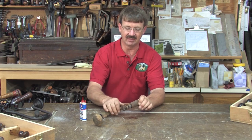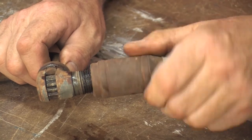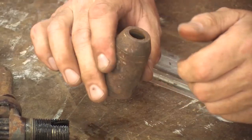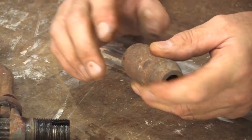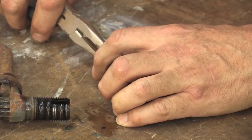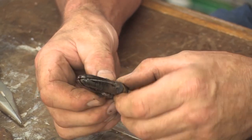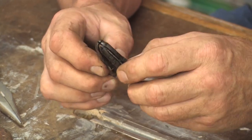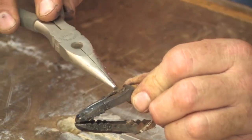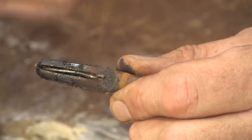Next thing I'm going to do is lock it and start to take the shell off, which will allow me to get to the jaws. For as bad as this looks, the oil got in there and oiled it up pretty fair. I'm going to tap my jaws out — going to have to grab it with a pair of pliers. These are spring-loaded, so you'll want to hold your hand over them. One side of the jaws is let loose and they are pretty gunked up. The spring should be in that jaw. Don't try to take them apart right now. We're going to try to get this spring seated — there's a small hole up in the backside of this jaw. I have disturbed the spiders today for all these tools.